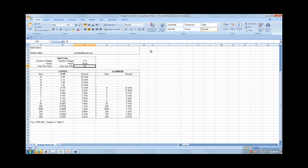Can you see this on your screen? Yes. Okay, so let's just say you're coming in series parallel. If you're using 3 panels in series, let's say you're at 51 volts. So that's about MPP voltage times 3 in series. And you're looking at probably coming in at about, let's say, maybe 925. How many amps would that be?